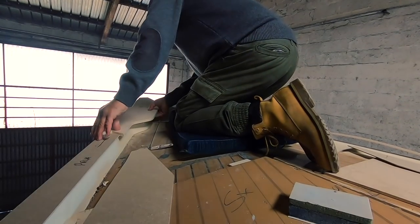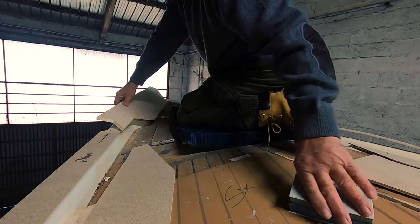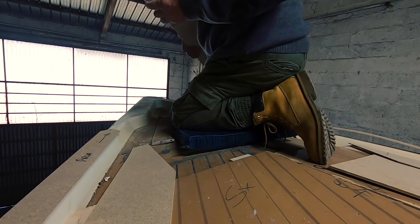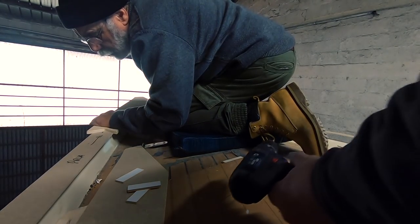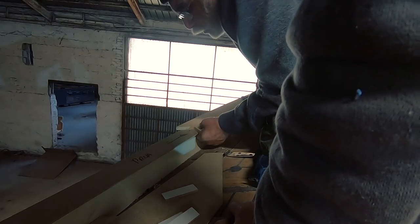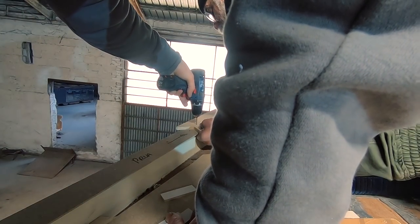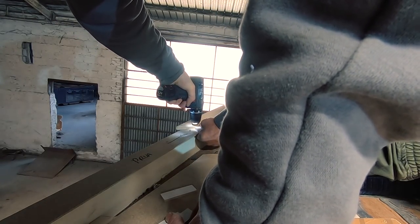They are quite perfect, so I will keep this template when finished — if I break one piece I can immediately copy it and install it on my boat. I cut many 5mm spacers to use between the pieces because I want to maintain 5 millimeters from the new thick cap rail.